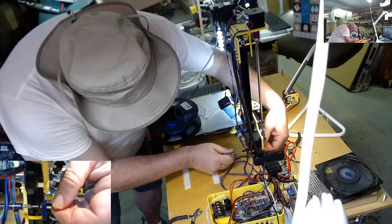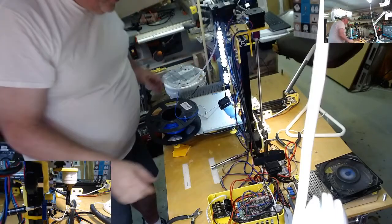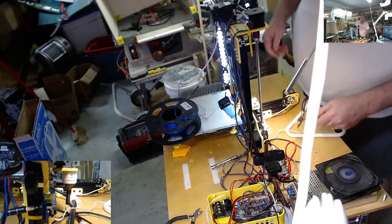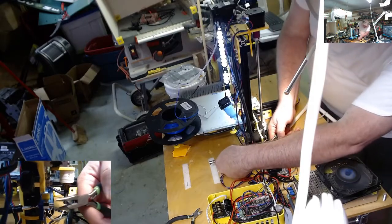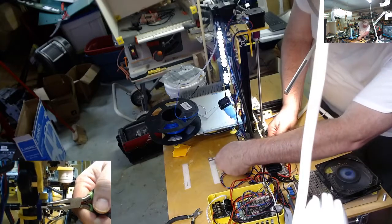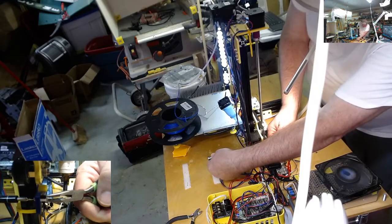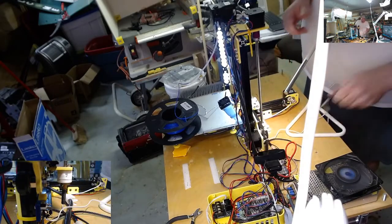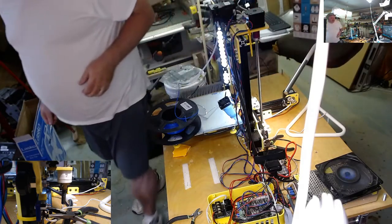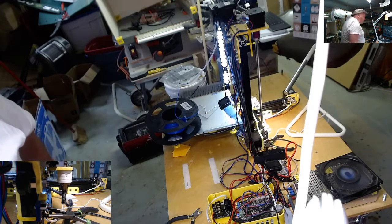Luckily, these bolts right here only need to be a little tight. They don't need to be way tight. There's a thing that I find a lot of folks have a real hard problem with, and they'll decide, ooh, I got to make this tight. There's a difference between tight and secure, because what I did right there looked like I was straining. I wasn't. I was straining to keep myself from over-tightening it.